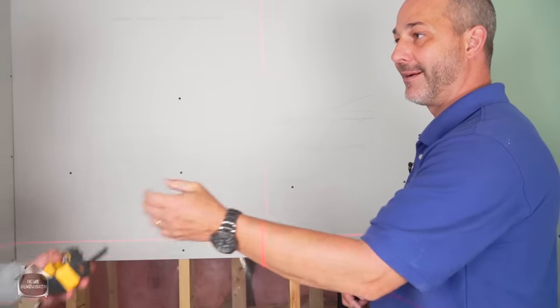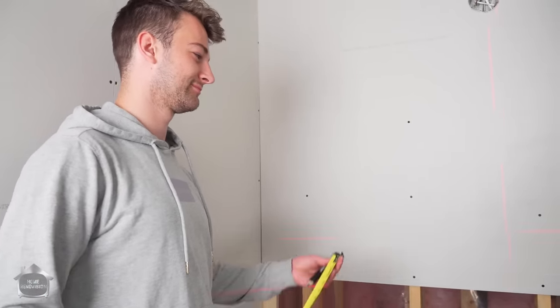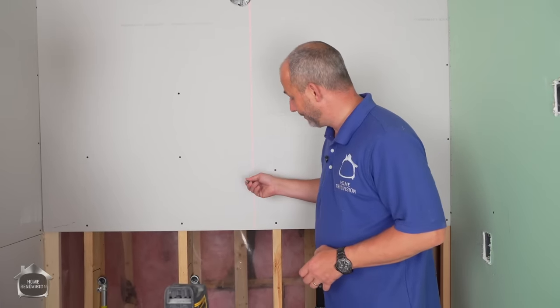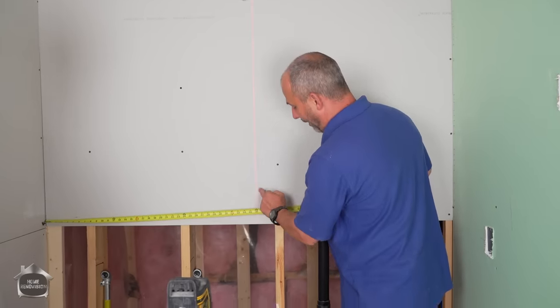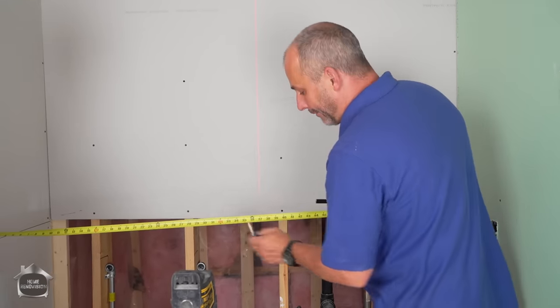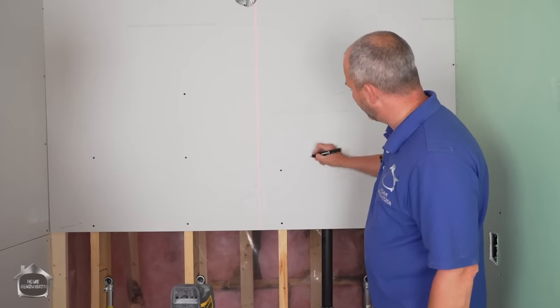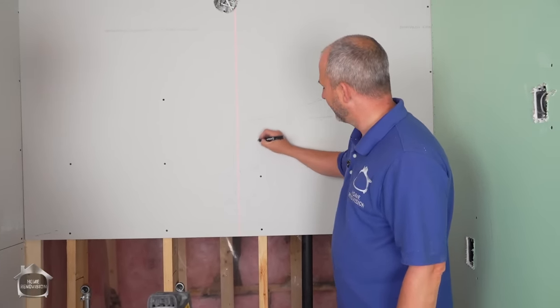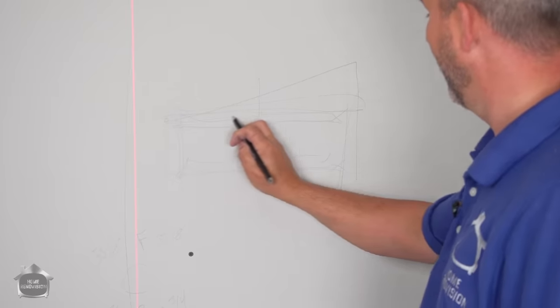We can always buy another one if you mess it up, but I'd rather not. So let's measure twice and cut once. Basically, we're taking this center line and measuring from this point to the wall on the back side, which is what that stands for, on the left and the right, and on the front side, left and the right side. And we're going to take our slab, throw a center line on it, and measure all four of those intersections so we can cut those lines, and then we can go straight across the back and clean it up. We're just going to drop that sucker right in there when we're done, and it'll be perfect.